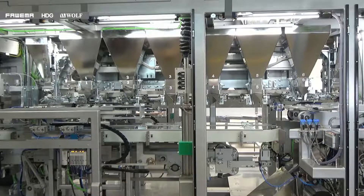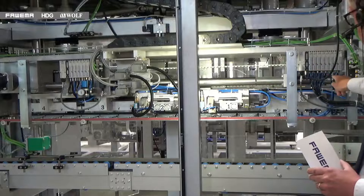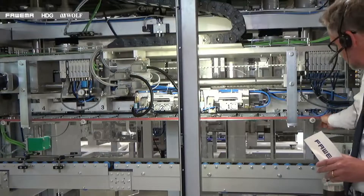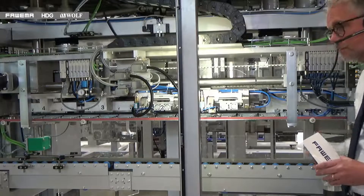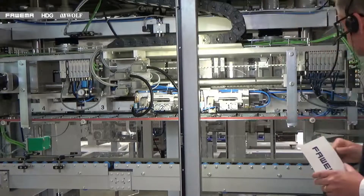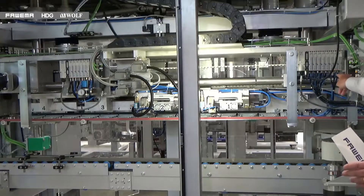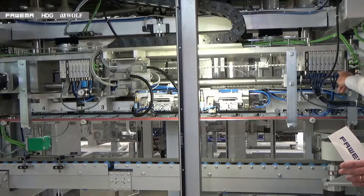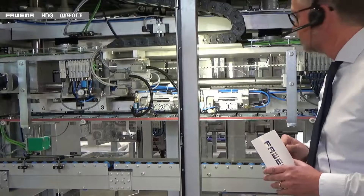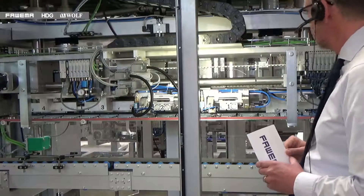At the very beginning of this section we transfer out of the grippers and into the top belt. You can see that thin red belt running through the machine here — this holds the top of the bag perfectly in position ready for sealing. The first section Mr. Barlandzifa is pointing to is a vacuuming system where we don't pull a true vacuum but we remove the excess air from the top of the bag. The bag has been mechanically pressed to remove excess air, and then we follow this up with a deaeration section where a pump extracts the remaining free air from the top of the bag.